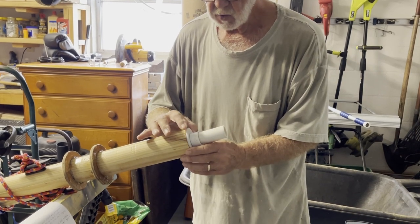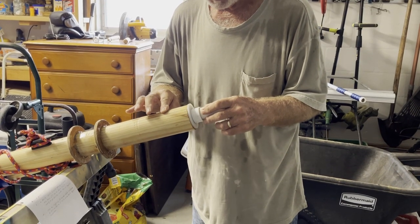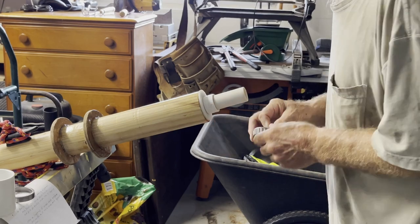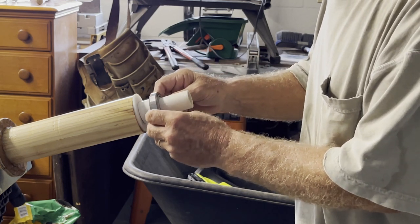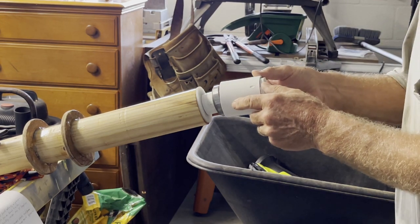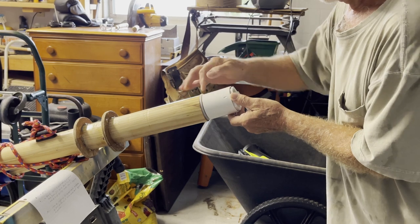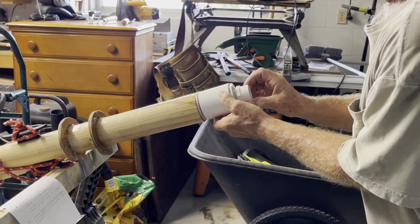I epoxied the disc — one disc — the coupling, and the pipe all together, and inserted it into the 3/8-inch hole that I drilled into the mast. Once this epoxy is all set, I inserted the bearing and housing in this direction. Then my 2-inch coupling and 2-by-1.5-inch reducer, all glued together, slip over everything. It leaves about a 1/8-inch gap right here. Then my 1.25-by-1-inch reducer, after it's cut to half, slips in right here.